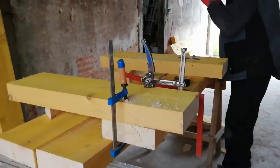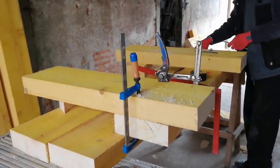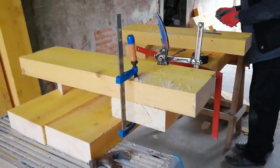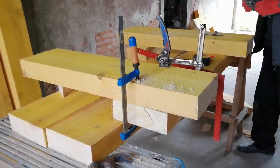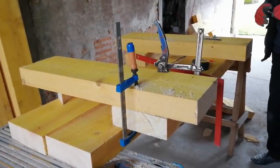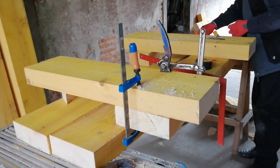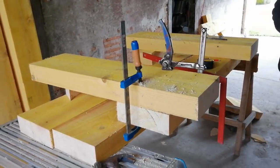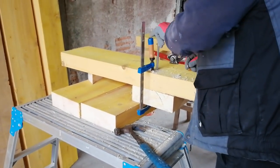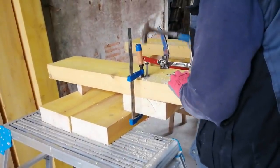So how did you know how to design this? You've made workbenches before. But what I'm saying is, how do you know what size pieces you've got to have to hold it all together? You see what you've got timber-wise. So you've measured how high you want it, to see how high you want the legs. Yeah, that's the only important thing. And then as long as you're connecting the pieces all the way around, it's not going to spread.